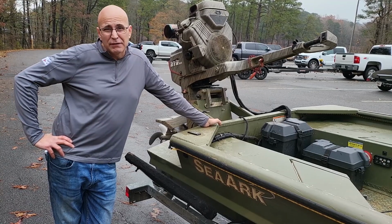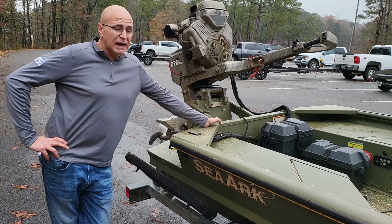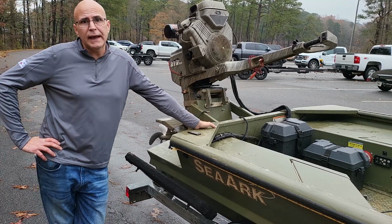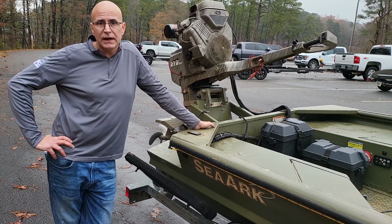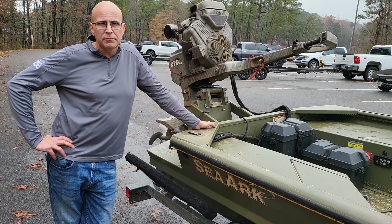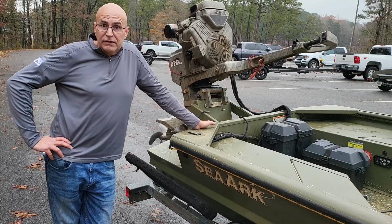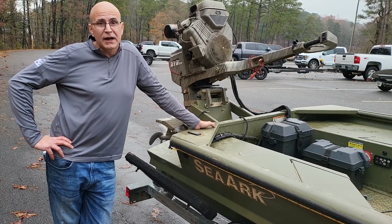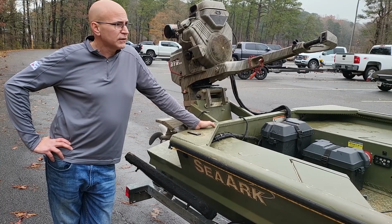So good to know that you can add 500 pounds to the boat and still get 22 miles an hour. Some of the things I did notice was I was running at about 4,000 RPMs when I was hitting 27 miles an hour. So it looks like there's probably a little bit more in her because she'll rev up to about 4,500, 4,700 is what I was noticing. Today is the first time I was able to run the boat with the tachometer, so things just never worked. I replaced it. But it was good to get those stats today.